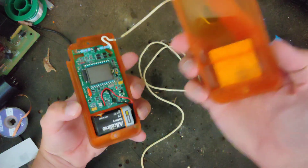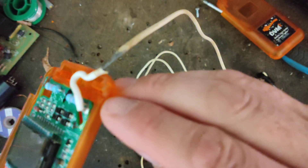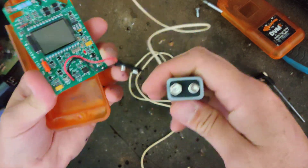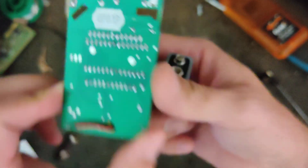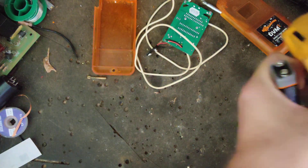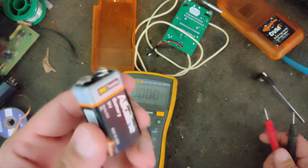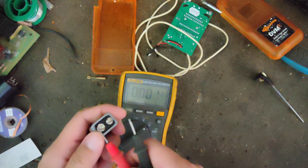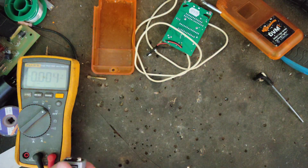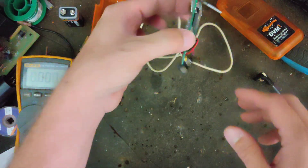Take those two screws off the back and we'll take the front cover off. You can kind of see how it's set in there — it snakes around and comes out this little hole. I'm going to unplug the battery where there's no juice going to it. It's a 2007 model. We're going to test this battery and see if it's any good. I can usually just do it by touching it to my tongue — it's got a pretty good bite to it. Reading 8.5 volts, which is a little low. A good 9-volt battery is usually over 9 volts, like 9.3 or 9.4. I think the battery will be okay, but I might go ahead and replace it while we're in there.